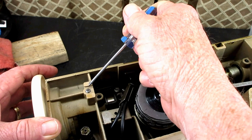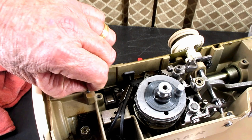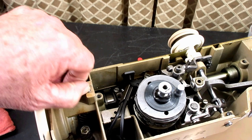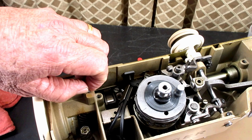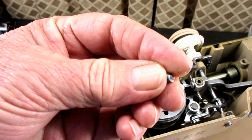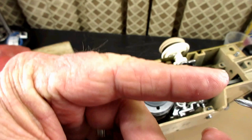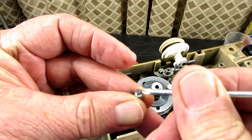Not like that motor cover mounting bracket screw I twisted off, or a set screw holding a gear onto the machine. Any screw that's affected by heat, like on a gear, they can be tough. But I've already got this twisting out just by my fingertips. Look at that — there it is. It had just a little piece of one thread sticking up, and just enough for me to get this point I filed down a little bit on the edge and start tapping it around in a circle.